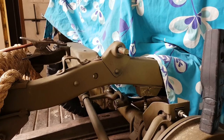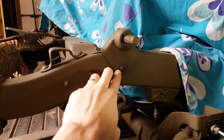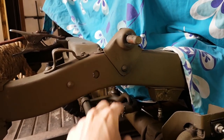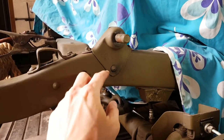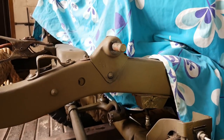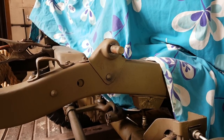On the side here, this rivet had been working itself loose and gone oversized on the hole, so the rivet was just sort of flapping around. Rather than messing with the rivet or building it up and reprofiling it, a neat little fix — not perfect obviously, but pretty good — is to put a bead of weld running around like that, taking the job of the rivet. It'd be hard to notice and it should do quite a good repair.